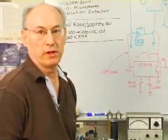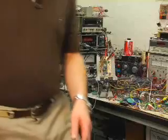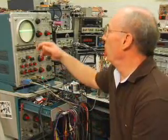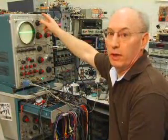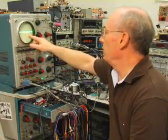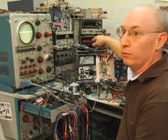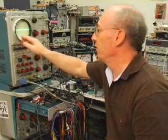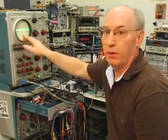What kind of performance do we get out of something like this? Let's go to the lab bench and take a look. The converter I have selected is a minus 1,000 volt converter designed for photo multiplier application, and I'll show you how we measure low noise. We go through a 40 dB low noise 200 megahertz preamp into the scope vertical and display on the tube. I'm measuring DC voltage on the voltmeter here. Right now the converter is off — I'm measuring my noise floor at quiescence. The noise floor of the test setup is about 100 microvolts peak to peak.